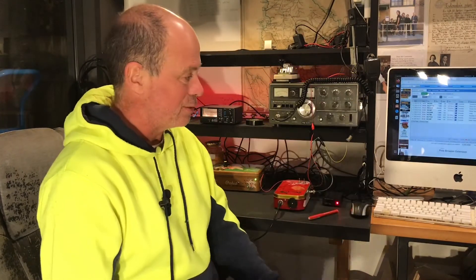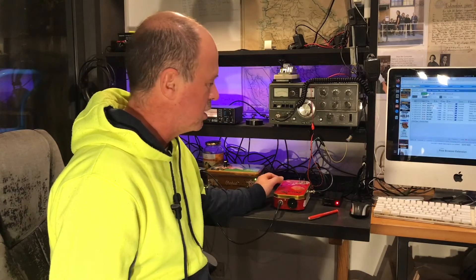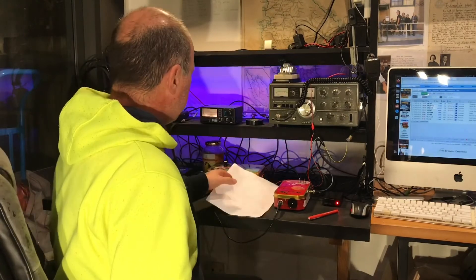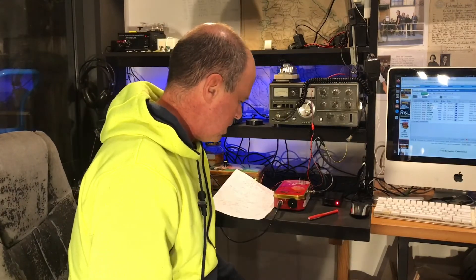When I had a look at his antenna setup I was amazed - he's got broadcast quality vertical antennas for both the top band at 160 and 80 metres. He chased me up and down the band because we were drifting all over the place. We've kind of got the drift under control - it's not perfect - but I realised I've got two switches on this thing: one controls the oscillator and one controls the PA stage. You've basically got to leave the oscillator going, which sometimes causes a bit of an issue with the receiver.